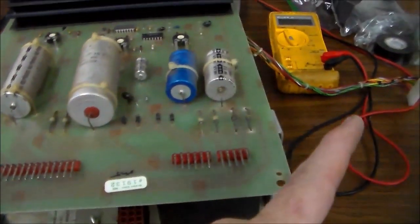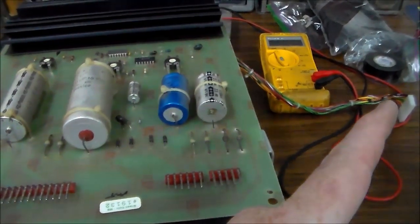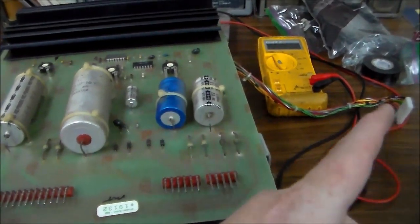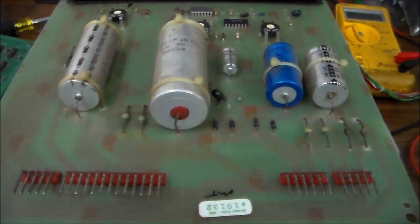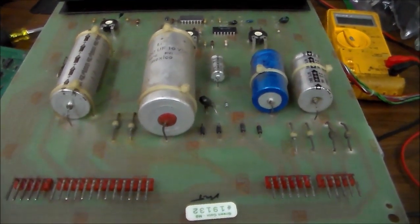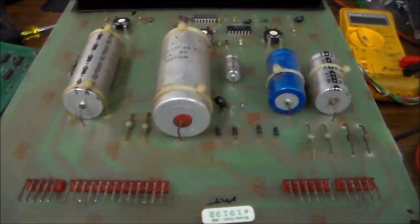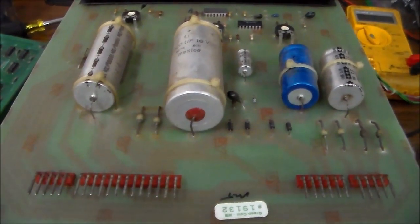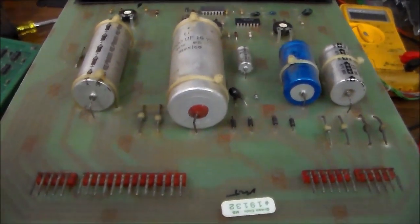The reason they replaced those pins is probably because some of those got damaged. Sometimes one of the wires will overheat. But you're talking about an environment where the thing's turned on all day, operated in an arcade for 6 or 7 years. Yeah, maybe sometimes you'd have problems. But we're selling games into people's home collections. They're turning it on every few days, maybe, if even that often. So if I can do it, I'm going to try to just repair this one.